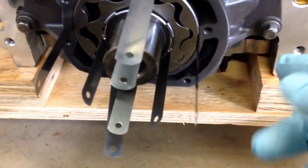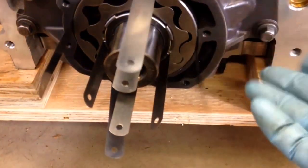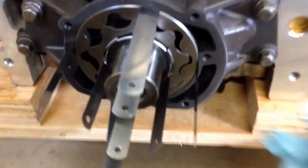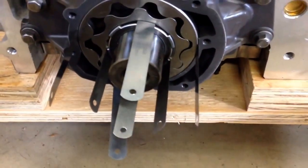Putting it together is the easy part. You just got to put the rotor in, put these bolts finger tight, try to get the alignment correct. And how you align it is with feeler gauges. So you got to break out all the feeler gauges here.